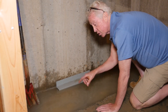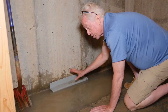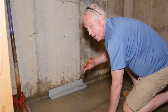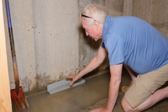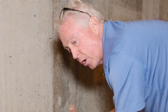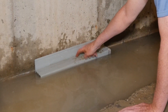That's not the way you want to go, especially with this particular type of foundation — you're always going to have a damp, moist, or even wet floor with this type of scenario. Plus when you re-cement the floor back you can't get it to the thickness that you need. Anytime you remove part of your basement floor you have to put back a minimum of three and a half inches and that's code. So this is a real problem — it's one you'd like to check with your building inspector before you ever think about doing a system that sits on top of your footing.